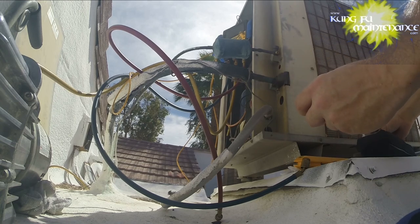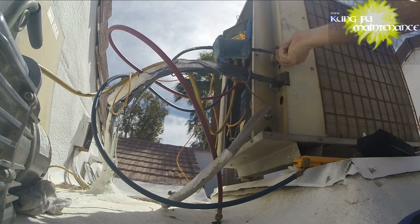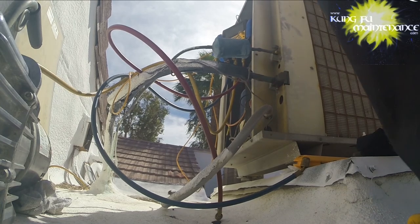Yep, and this just confirms what was going on, that we were losing the refrigerant. Also, you can see the marking on the sidewall. That's where we lost our charge from. Yay, we're in. Now I can re-pull a vacuum and get this thing on the road. All right, get it charged up and do everything how we want to.